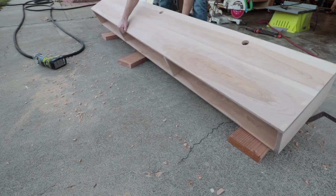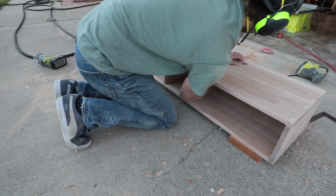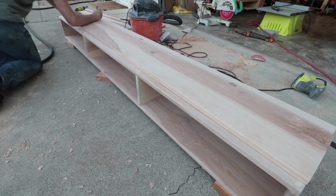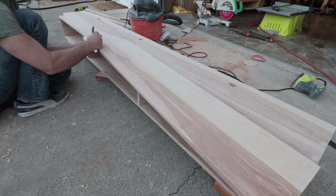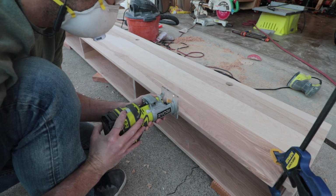Another thing that I had been trying to figure out was how to make an easy way to lower the door. I wanted it to be discreet, so a handle or knob was out of contention, and any finger holes would look ridiculous. So my solution was to route out a few angled slots on the top edge to act as finger grabs. I made 3 grabs, each one in line with the 3 holes on top.